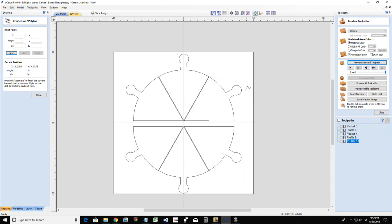Cut these three out of one 10-inch board, these three out of another. Now, the opportunity this opens up for me is if I have a nice, let's say 10-inch by 1-inch board, or maybe 1 1/8, I have the ability to resaw, and I've got a really sexy looking book match, right? When these two halves are together after it's resawed and folded down, I've got a pretty book match, bam. I can cut these out, and when these things come together, that book match comes together. You know what I mean?